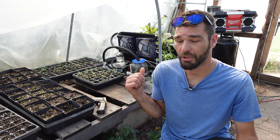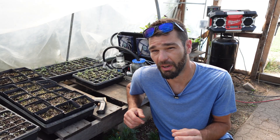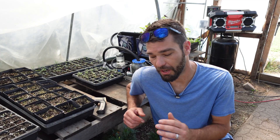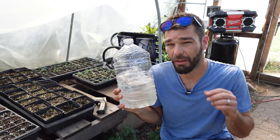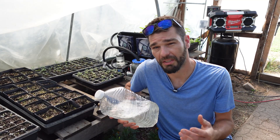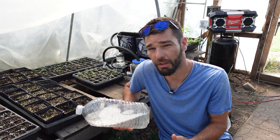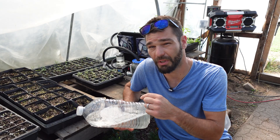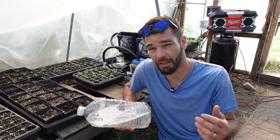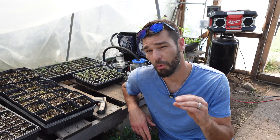So this is not just water — we've got vegetable glycerin. This stuff is almost like jello; I would describe it as jello before it fully solidifies. It's like a warm honey or molasses, very thick. What we did was take one gallon of water and mix slightly over five cups of vegetable glycerin into the water, shook it up really well. We wanted 33% glycerin to 66% water. That gives us a freezing temp — this is an antifreeze that will be good to negative 40°C, negative 40°F, and I've read it could be up to negative 46°F before it actually refreezes. Glycerin itself technically freezes between 60 and 70 degrees, but it doesn't actually freeze — it just becomes more of a solid state, like a very slow-moving fluid.